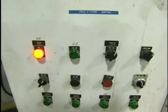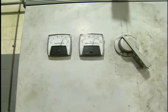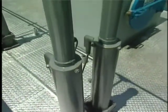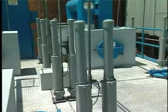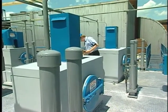If there is a decrease in voltage together with an increase in current and a low or zero sparking rate, there is likely a short in the field. This may eventually result in the field tripping offline. A decrease in voltage together with a decrease in current and an increase in sparking rate may indicate a rapper failure. A walk-around inspection of the unit is useful in identifying non-functioning rappers.